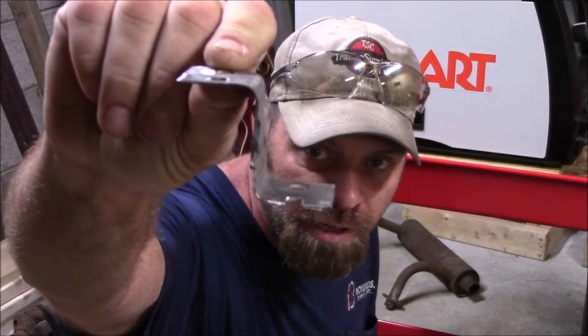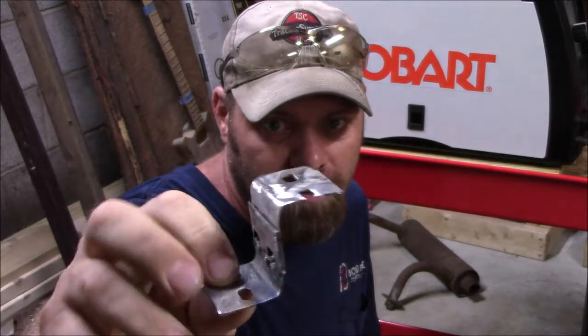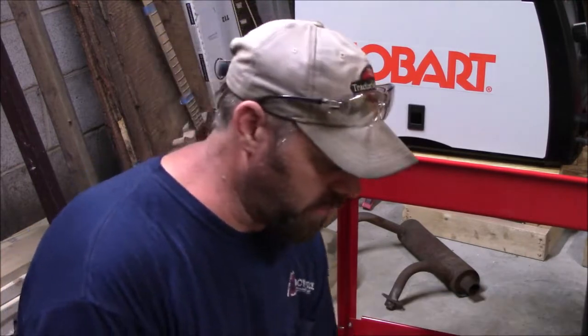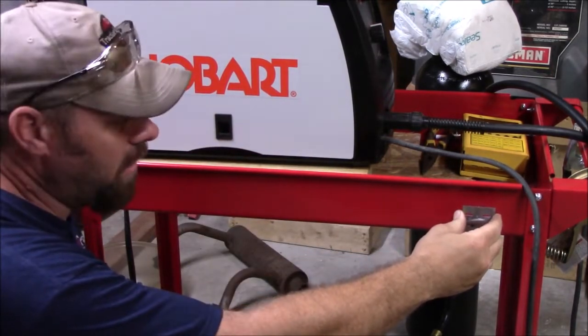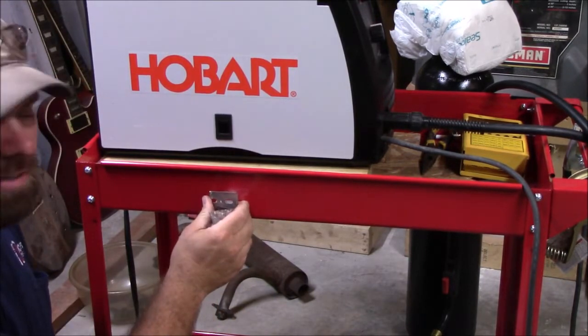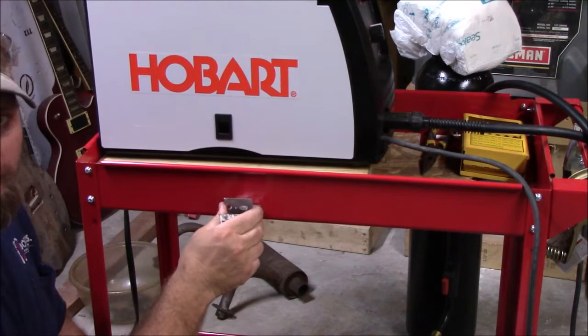I got my two brackets here — you can see what I'm going for. I got them pretty much the same size and they're all ground down for paint. What we're going to do now is go ahead and drill some holes to hook these things on. They're going to bolt on like this — one bolt right here and the other about right there. I'm going to put about 18 inches in between them, so the first one here and the second one about 18 inches back.